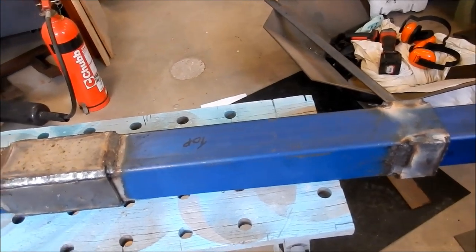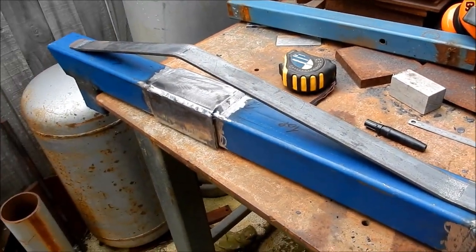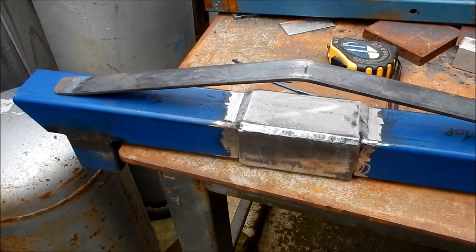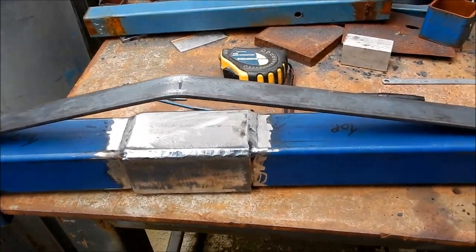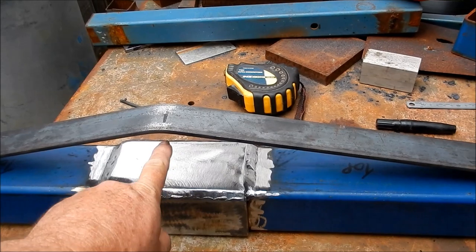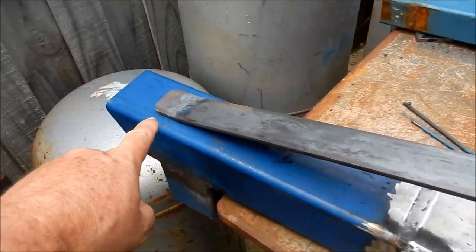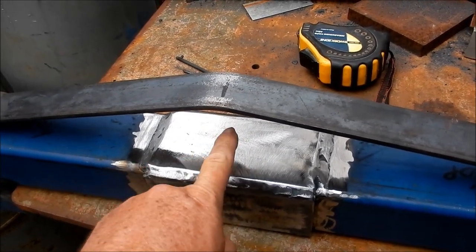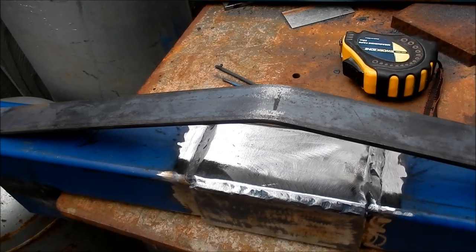We'll preform the chord section of the truss and get that into place. That's how our truss cord turned out - it's much easier to just bend it in the vice and put heat on it. The little oxy-map gas unit doesn't put a lot of heat out - okay for brazing and silver soldering but I'm going to get one of those Bullfinch units that Rob from Xanidu uses. We've got around about 70 millimeters underneath which is what the existing one had. I'll weld the two ends on then work the section in the middle so it's a hammer fit - applying a little bit of tensile stress to that cord member.